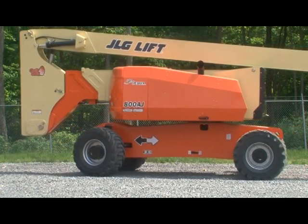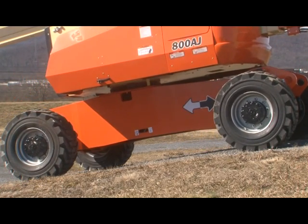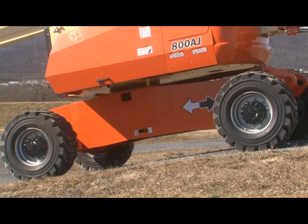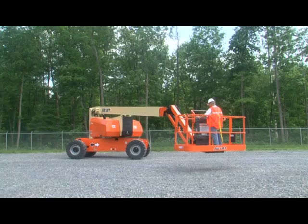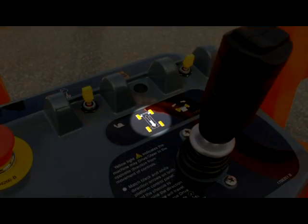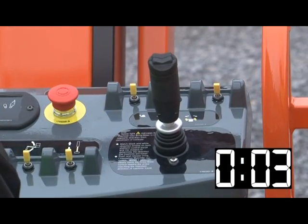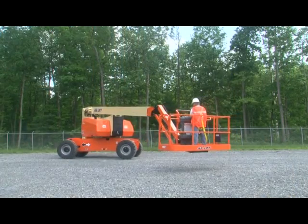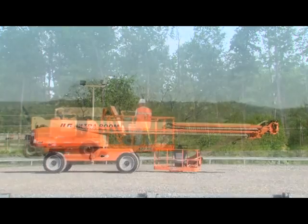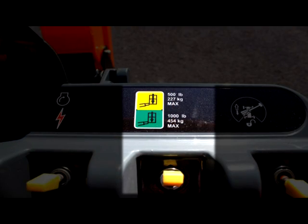Test the steering. Next, check the brakes. With the boom in a transport position, drive onto a grade that does not exceed the maximum grade ability and stop — the machine must hold on the grade. If equipped, check the drive orientation override switch: position the boom over one of the rear axles, then match the color of the directional arrow on the frame with the color of the directional arrow at the drive controller to the intended direction of travel. Attempt to drive without engaging the switch — it must not drive. Test the three-second enable timer by engaging the switch and waiting a few seconds, then attempt to drive. Re-engage the switch, then drive. If operating an ultra boom, there are additional functions to check, such as the axle extend/retract switch, the capacity select switch, and the boom control select switch. Always refer to your model's manual for a complete list of functions and how to check them.